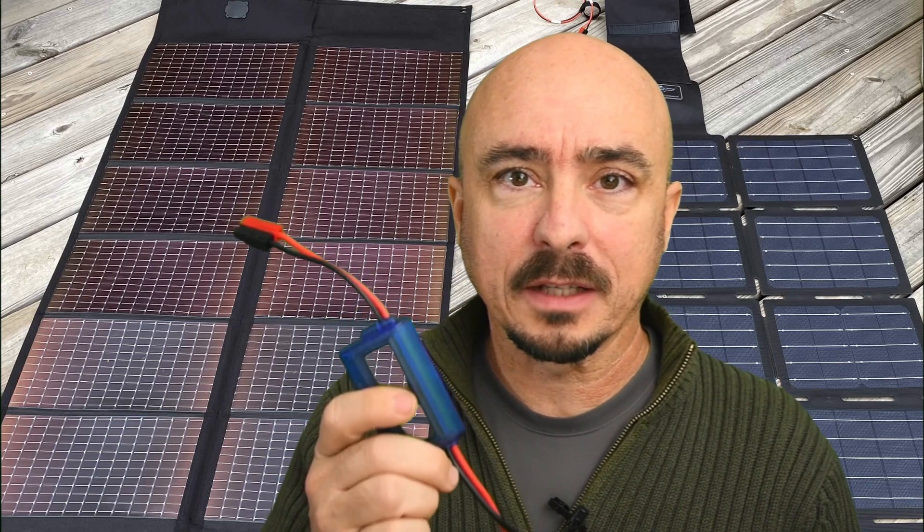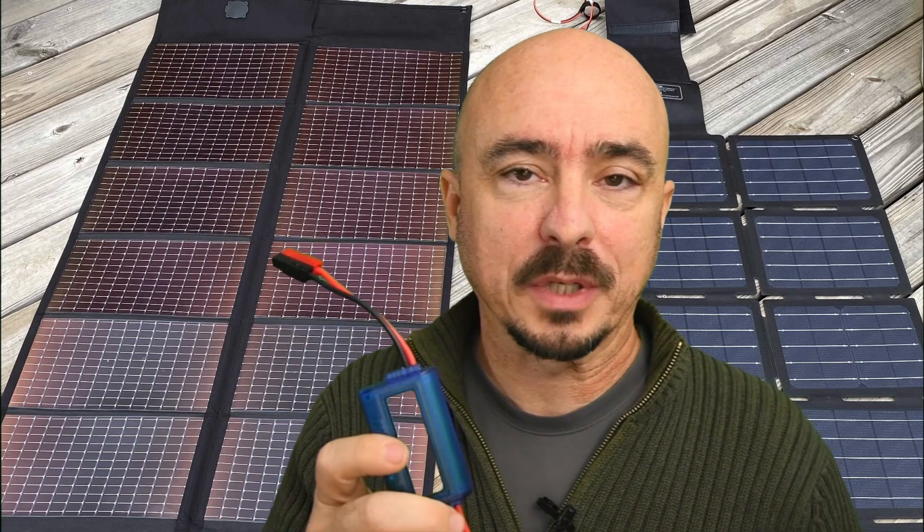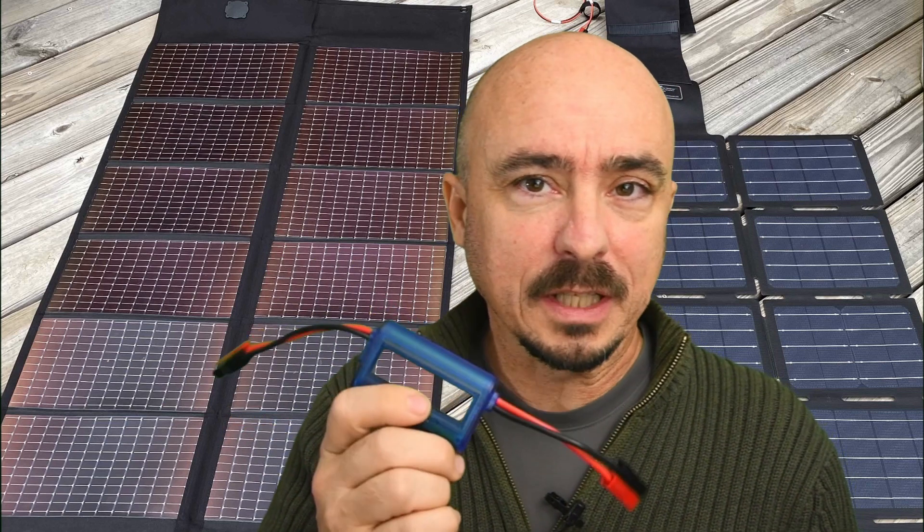You can use a little meter like this — I'll leave a link to one of these watt meters down in the description below. You can connect it to your radio and look at what it's drawing on receive. Then set your radio to a certain power level and repeat that test to see what the radio is consuming on transmit. I would recommend doing this at varying power levels — maybe 5 watts, 10 watts, 50 watts, and 100 watts. That'll give you a good spread to know how much power you're going to be consuming from the battery at pretty much any power level.